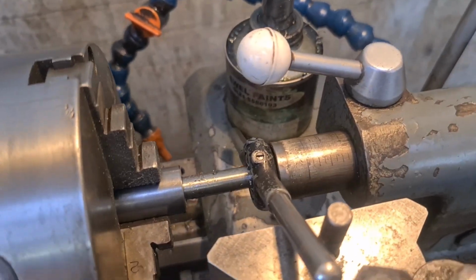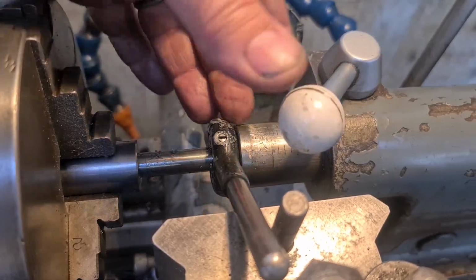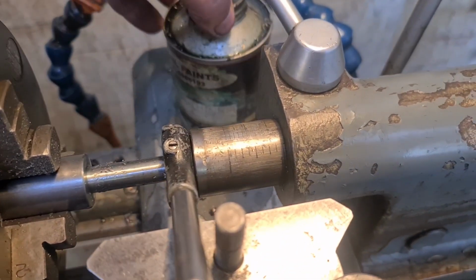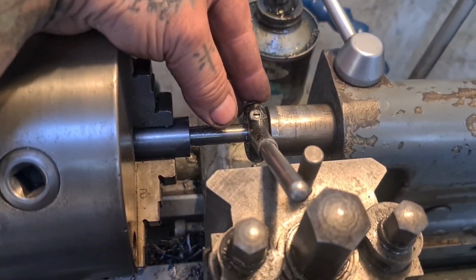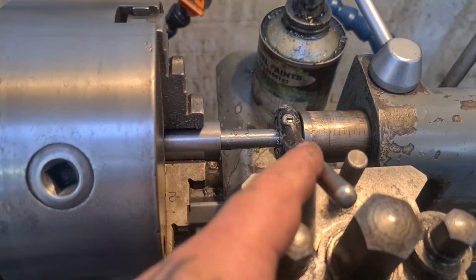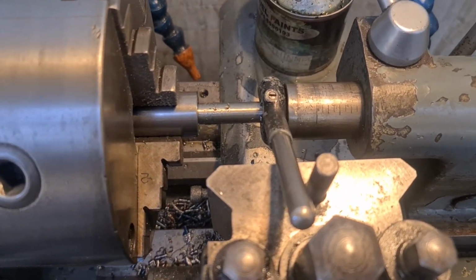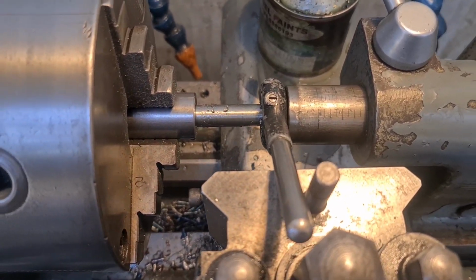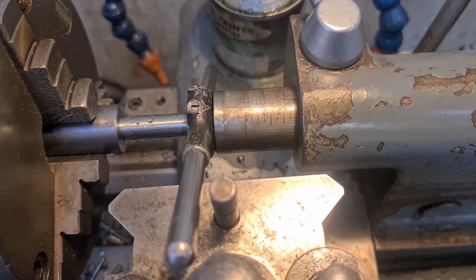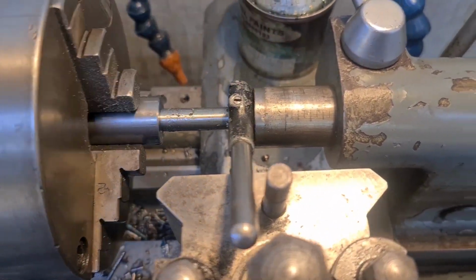And now, as you've seen me do before, I've got the tailstock up against the die holder, resting against the tool post which I've rotated. That's going to support it while we just feed in really gently and slowly. And what should happen is it will start cutting thread and take it off the die holder. The tailstock should make a gap here because it will draw it up.